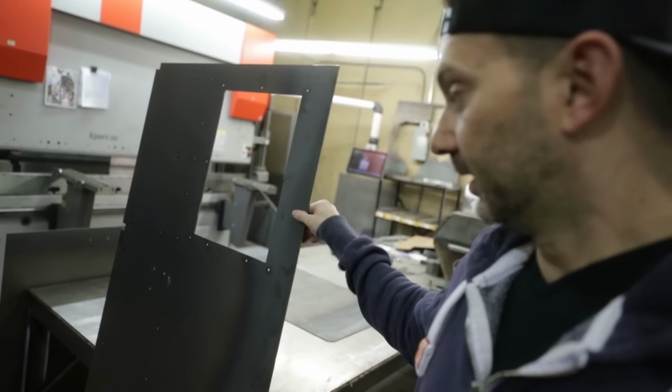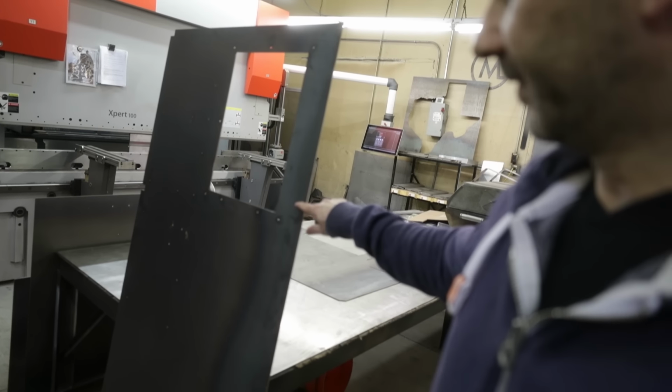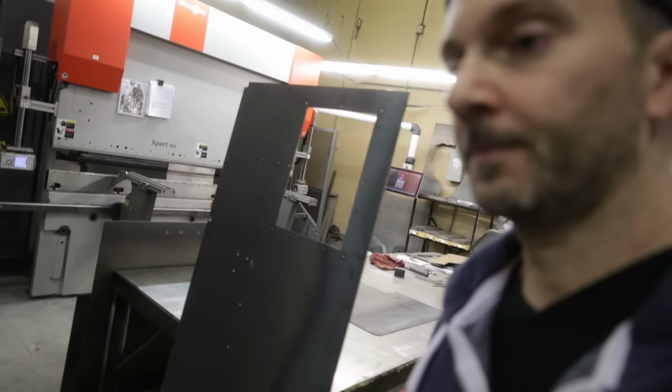So in this right here, this is the bottom body. It's all cut on the water jet from one solid sheet of steel. And then it's all 10 gauge. Then we're gonna take it on the press brake, we'll bend it. And everything is very, very precise. That's why we use the tools that we use, because it's the only way to get things precise every time.